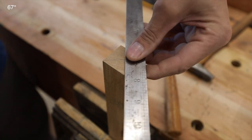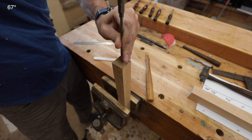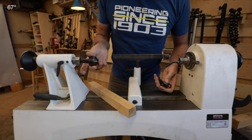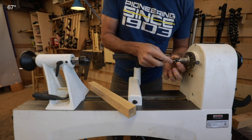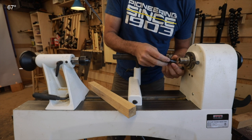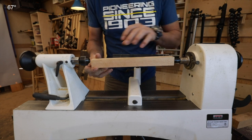I'm so annoyed with myself — my friend Stu showed me a better way to do this in the shop and I completely forgot about it. I really should have paid better attention in wood shop class. I think it's called the tail stock here. This is the chuck or the spur that came with it, and it had some scary moments because once those teeth dig in and you put too much pressure, that wood's got to go somewhere — these lathes are powerful. Anyway, my buddy Stu brought me this safety tip that fits in there. If you put too much pressure on it, it just spins rather than tries to kill you and take out your window.